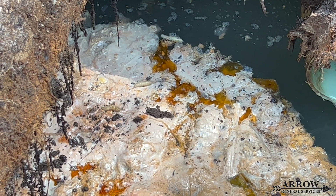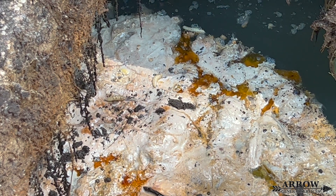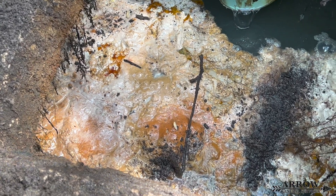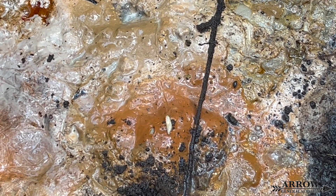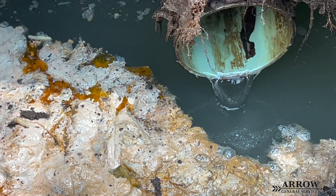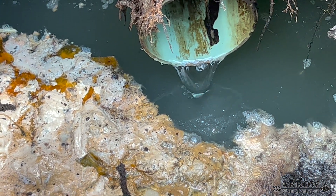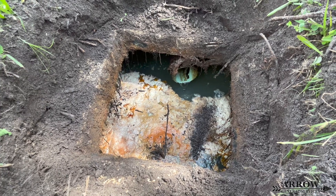The way you can tell that your leach field is functioning properly — after checking the baffle and baffle filter and finding no clogs — is that the water level will remain the same even when adding water into the system. As long as it's not large volumes of water back to back, like using a washing machine and doing three or four loads of laundry — that's a lot of water for a septic system meant for a two bathroom, three bedroom home. A larger leach field will handle a larger volume of water, but if you have a smaller system I would advise spacing out your loads of laundry, because the washing machine adds the most water into the system the quickest.